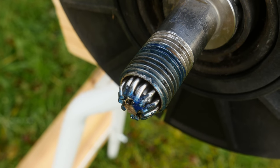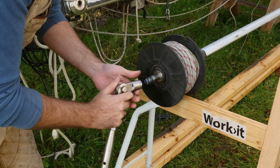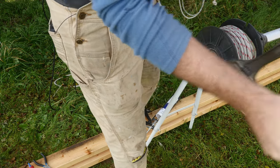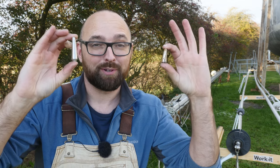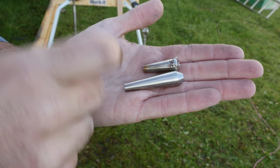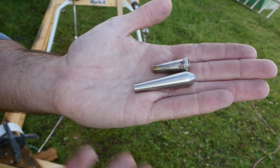That looks perfect. I'm gonna fill the cavity in here with some sealant and put this on permanently. With the right cone on here, this was surprisingly easy. So if you're replacing the headstay on your boat with an older Furlex unit, it might very well be worth it to check the shape of your cone. It is worth noting that you don't necessarily have to replace the cone or the former that's inside of the bottom part of the fitting, but I just wanted to do it.